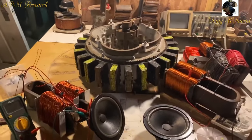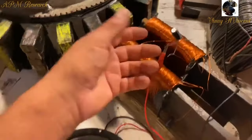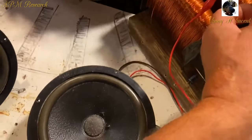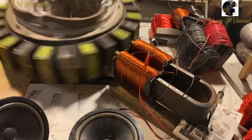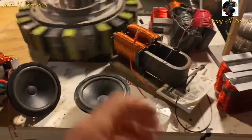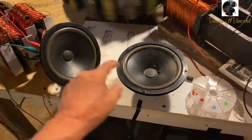But with that all being said, back to here. You got the capacitors you can change. So we can change the pitch that's coming out of the speaker by changing the capacitance. And then you can see how we amp it, that we can get something to come out of it. I guess the next thing we would want to learn, which I would like to teach or put out there, is how to talk into that. So basically, if I take another speaker, it acts like a microphone, and talk into it, it comes out there.